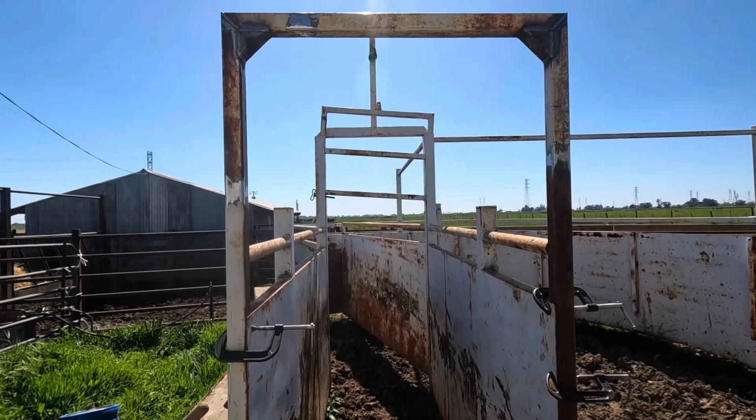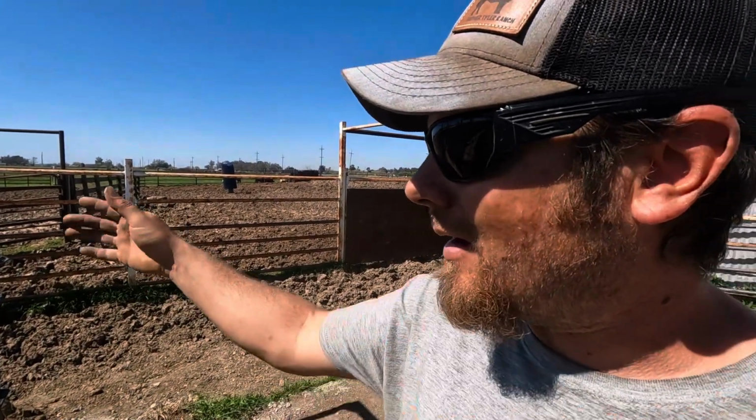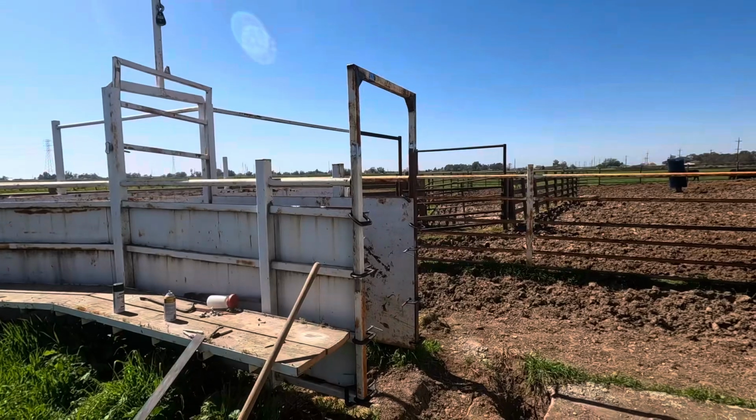I've got a pretty rough fit up here, and I'm just trying to see if everything is going to work, if we're ready to go right away. But it looks like I need to do some grinder work. This last horizontal square tube on the bottom didn't cut very straight, and it's pushing this whole thing out. So I need to square that up, and obviously we'll need to clean a bunch of paint off of all this stuff before we start welding. But other than that, it's looking pretty good.